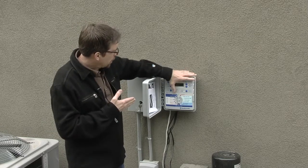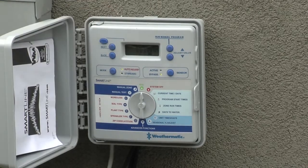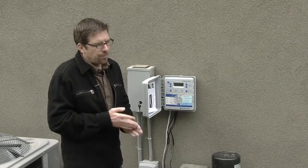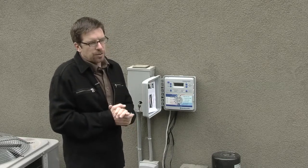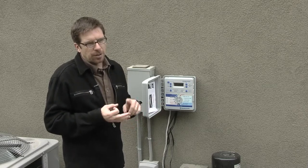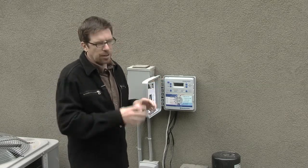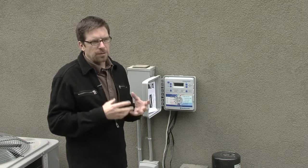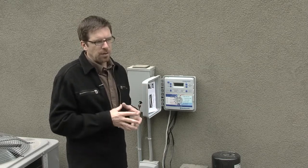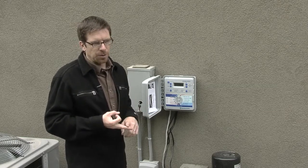On this one, you can have it on standard programming, or you can also go to auto-adjust. On the auto-adjust feature, instead of programming in hours and minutes and days for the sprinklers to come on, you just designate in each zone the plant type, the soil type, the slope, and the type of irrigation you're using. Then the smart controller is tied into a weather station that determines the needs of those plants based on that type of irrigation, slope, and soil type — based on the weather, whether it's been rainy, the amount of heat, the evapotranspiration rate, and so on.